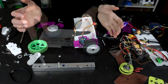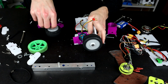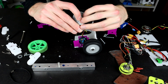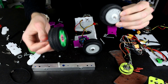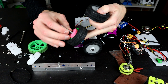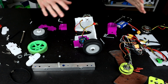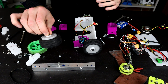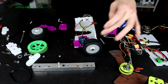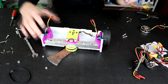After looking over the CAD I can't see why the wheel would be bent out of shape the way it is. I think it's actually because these wheels at the moment are solid flexible PLA, so there's a little bit of flex in the actual mounting of the bearing - unlike the ones I had in Boris, which had a flexible outer and a hard PLA inner so there wasn't any flex. What I've decided to do is continue on with these new parts, put Annie back together, and hopefully get her driving. If this doesn't work with fully flexible wheels I have parts that will allow me to use these wheels anyway.